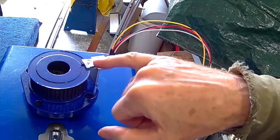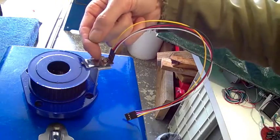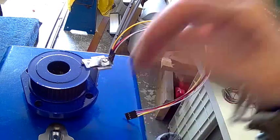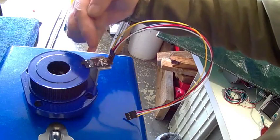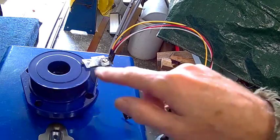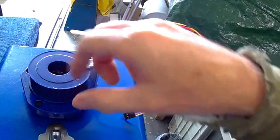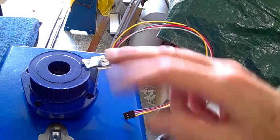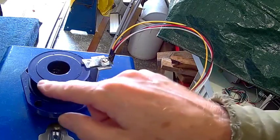I've cut up a piece of the anti-static plastic container it was shipped in, because there are a couple of solder points underneath the circuit board that weren't completely flat. I've recessed that slightly and placed it underneath to protect against shorts — it also may stop coolant or dust from falling onto the board. The little 3mm rare-earth magnet is held in by magnetic attraction with the north pole facing down toward the metal pulley. The spray paint will also help hold it in, so it's a combination of the two. You could add a bit of araldite over the top if you like.